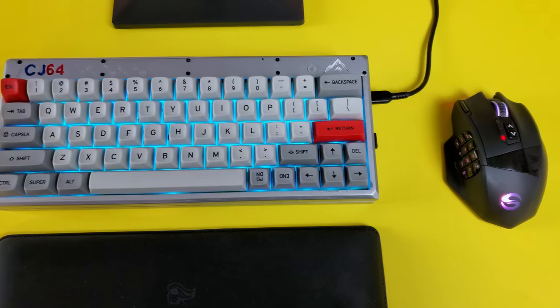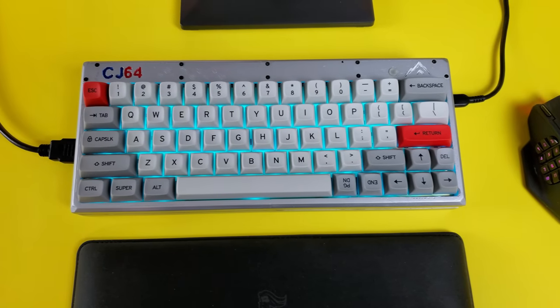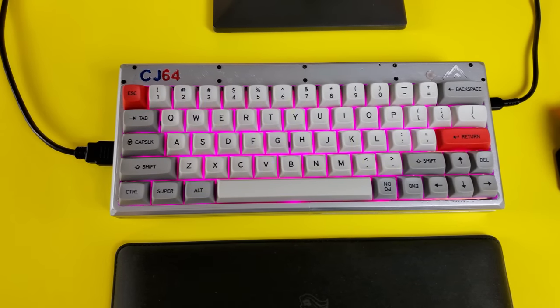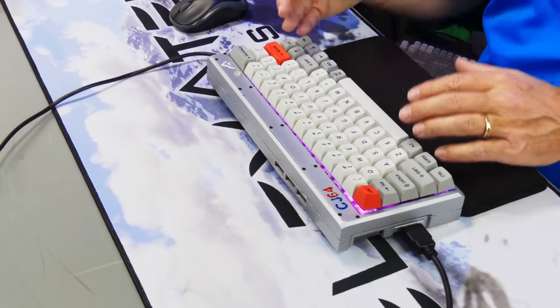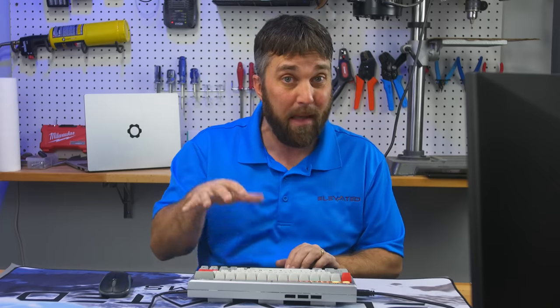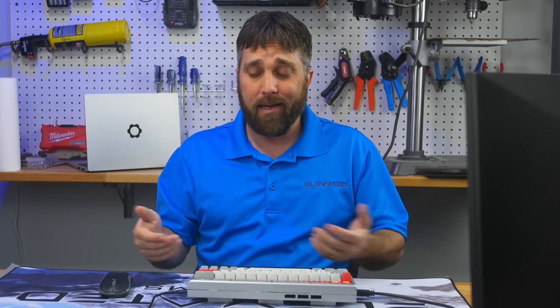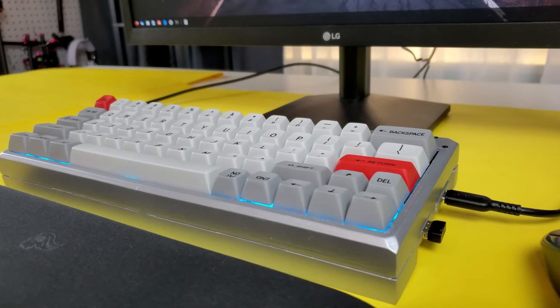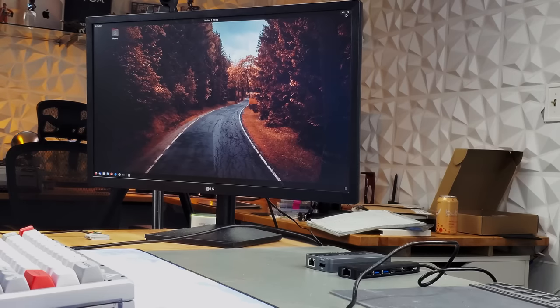so it's not really worth the effort, in my opinion, especially because this is a desktop system and will be on mains power 24/7. Keeping a lithium ion plugged in and charging at 100% 24/7 will seriously degrade it quickly. And if you think it's a smart battery and that doesn't happen, well, this isn't the case for this battery. Mine's already 3 to 4% degraded in less than 4 months, and I don't keep it plugged in when I'm not using it.